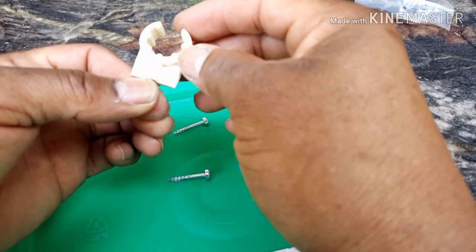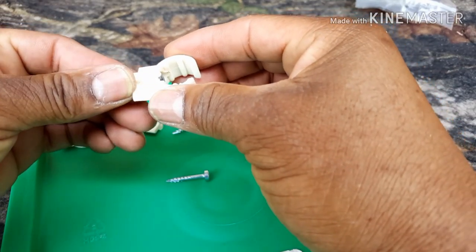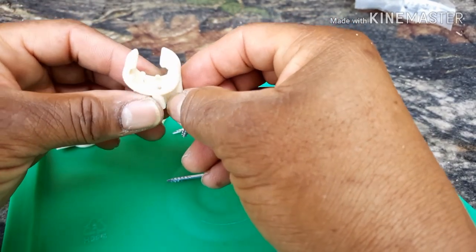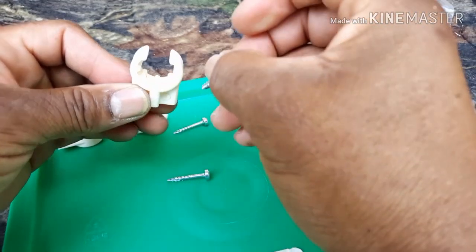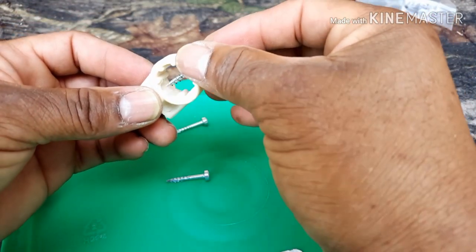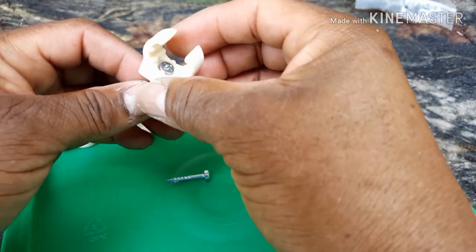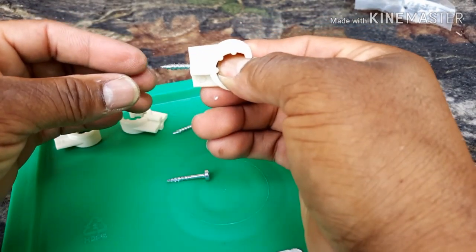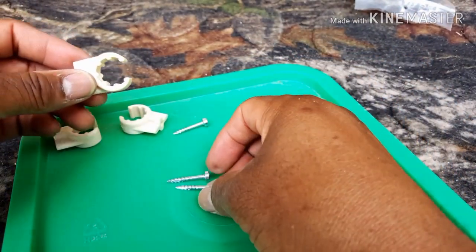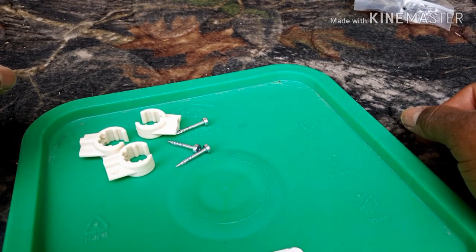I have the clamps in two sizes — both half-inch and three-quarter inch; this one in my hands is half-inch. I really like these clamps. I'm using them with a Kreg screw, about an inch long. Even though it doesn't have the tapered seat the clamp calls for, the Kreg screws fit into the little space rather nicely. I like Kreg screws because you don't have to pre-drill — they're engineered so they don't split the wood when you drive directly into it. I use a square number-two drill bit to secure those screws as opposed to a Phillips head.